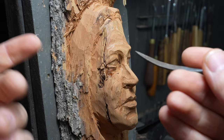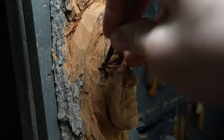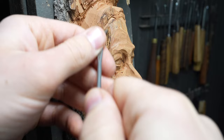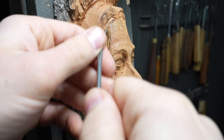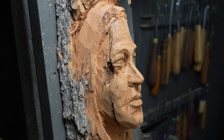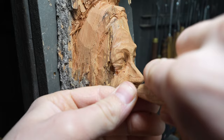The first thing I want to do is use a file, a piece of metal, or even a gouge to clean out the extra material — the bits of rotten junk. Then I'm going to use a straight blade knife, about an inch and three-quarter bench knife, to cut out a section for the block to fit into. Remember, the orientation should be the same as the wood.